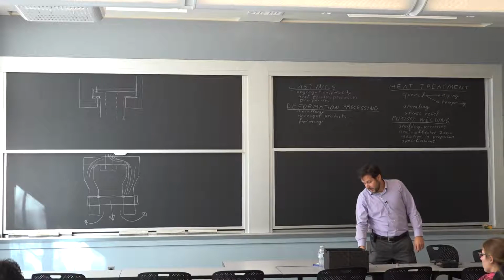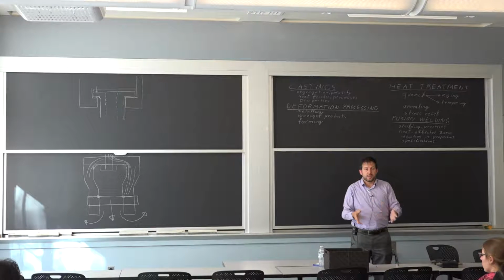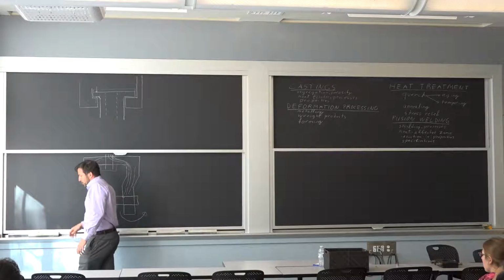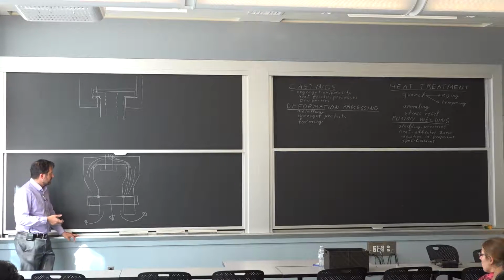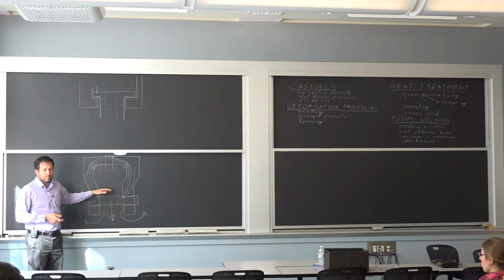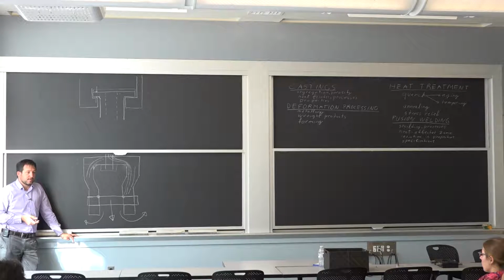This particular issue of stress risers in fittings, any equipment subject to vibration, compressors for natural gas equipment, I've seen it too many times. It's just so unfortunate because let's say now, let's take the next step where we have a very nice forging of steel, or what else could we have? Just a very nice machined part of steel. And we have this condition, but it's not a constant load. The load is varying here. So instead of the steel deforming once and holding for an infinite life, it starts weakening because each time it's forced to expand and compress locally, and that's what we call fatigue.